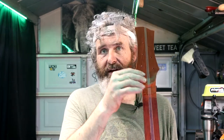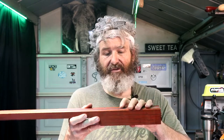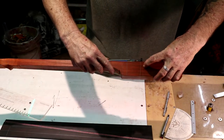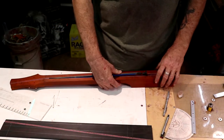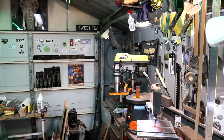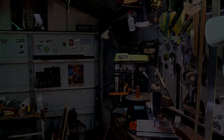I've got my headstock sorted and the volute started. I really love that — I think it's going to turn out killer. We need to cut the end of this neck off. I'm going to cut this slightly beyond the 22nd fret, which is going to leave me about two and a half inches of neck pocket bottom. According to Ben Crow, that should be fine. Let's turn the vacuum on and just cut it off.